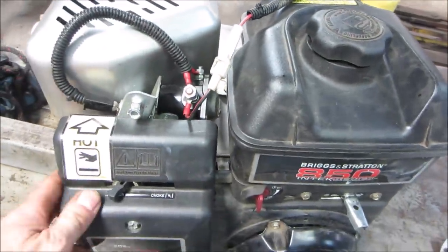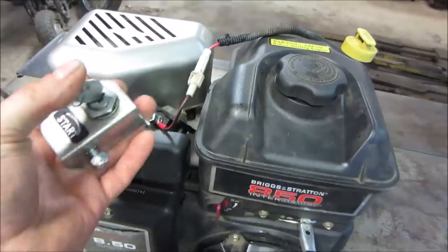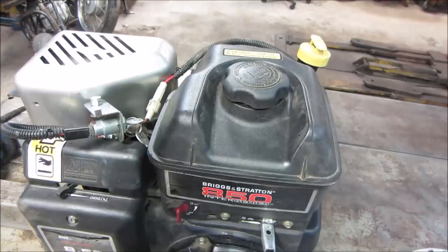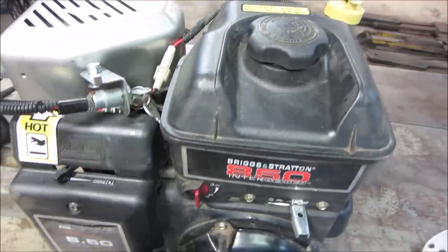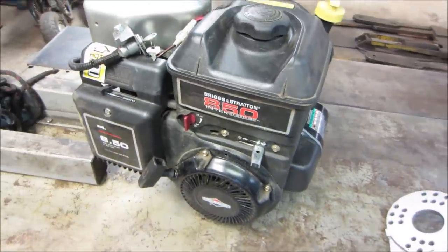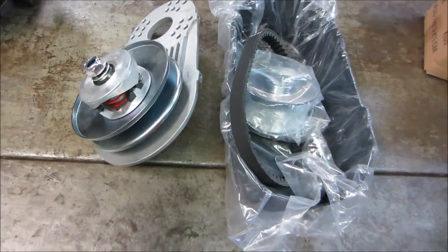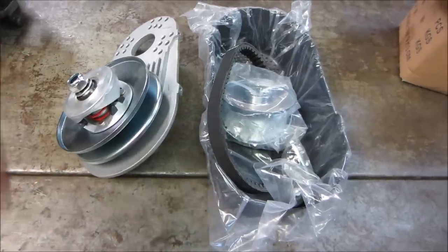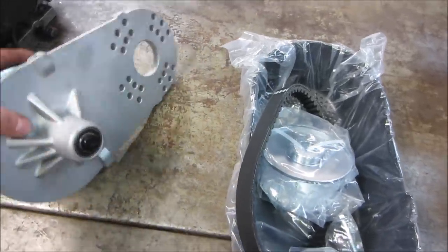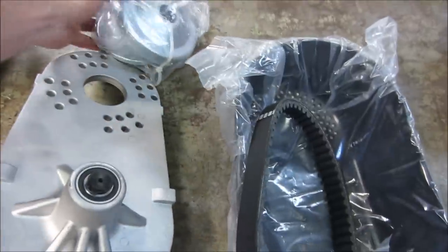This engine right here from Craigslist has electric start DC, and because it has electric start DC it also has 12-volt output, which gives it a charging system so we can charge a battery back up. It has a starter relay and wire coming off of it, and a key. So it takes care of the electric start and the charging system. The horsepower of the original engine was around eight and a half to nine and a half horses. The structure of the boat is compatible with that. It needs a variable speed transmission - the best cheap option is a CVT type setup or torque converter.